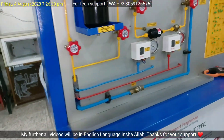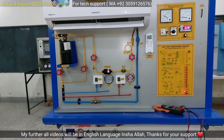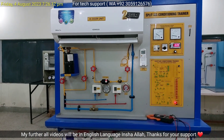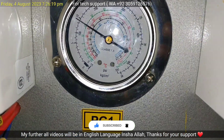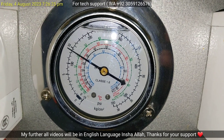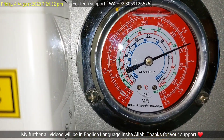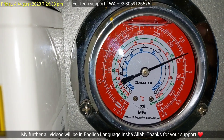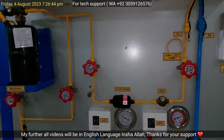In the next video part, I will teach you about the LPC and HPC — the low pressure cutout and high pressure cutouts — their importance in the air conditioner unit and how they operate with an R410A air conditioner unit. Here you can see once again at the low pressure gauge the evaporating pressure has slightly increased to about 140 PSIG, and the condensing pressure has also increased to about 395 PSIG. This is because both the evaporator coil and condenser coil are placed in the same room.